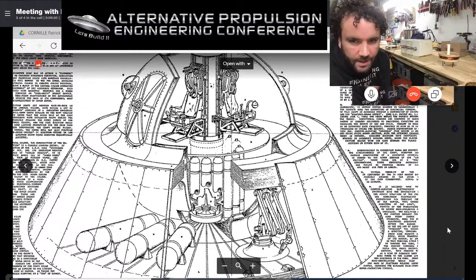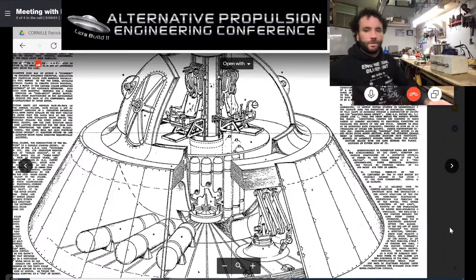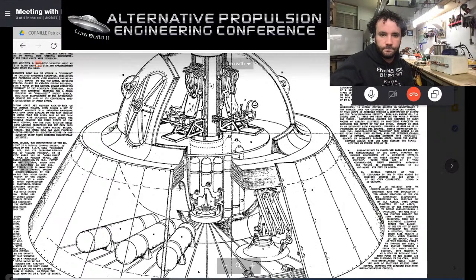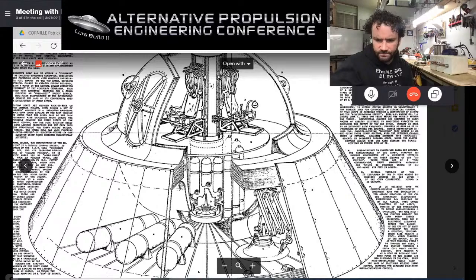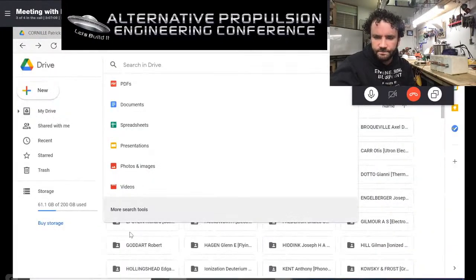And then on top of that, we'll pour epoxy. That stuff's reliable. We could pour epoxy and just get it all covered properly so that there's absolutely no way for it to short to itself, because that is what we are seeing with both coils. So that's something to work on for the next phase of this experiment. I can't wait to build the all-electric motional electric field generator there with all that wire. That's going to be one heck of a build and rather cumbersome, bending that wire back and forth some 2,000-something times. But we can do it. That'll be very interesting to test on the full scale, just like was originally set up in the patent.